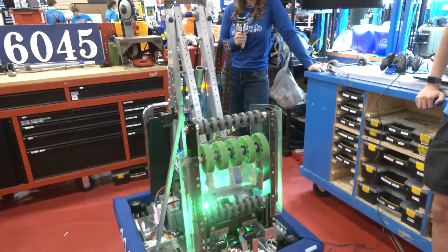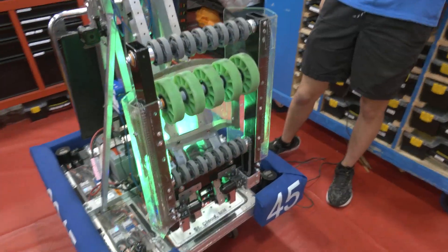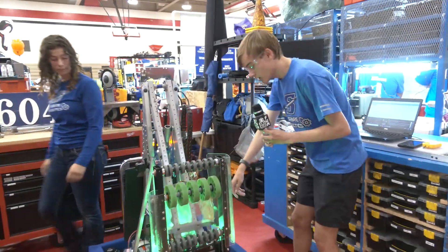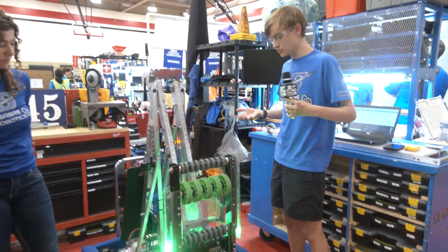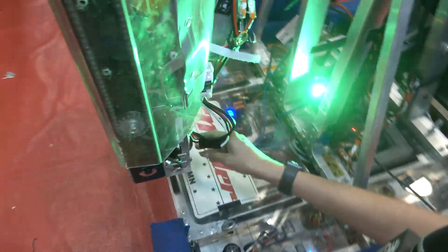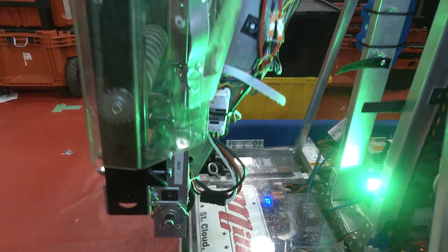That's a lot of balance on your robot for sure and definitely looking great. Seth, as we talked about the wrist and the intake to wrap up on your robot — we talked about how this is an EveryBot-inspired intake, but talk to me a little bit about your wrist and anything you want to wrap up with on your intake too. So we were building our robot around PID for easy maneuverability. With that, we ended up going with a 375 gearbox on the wrist, which allows gravity to not be able to push it up and down at all, making the PID much easier to plan for.